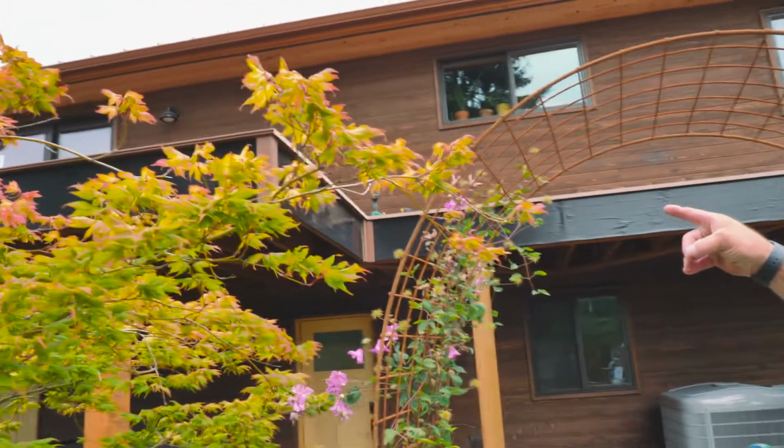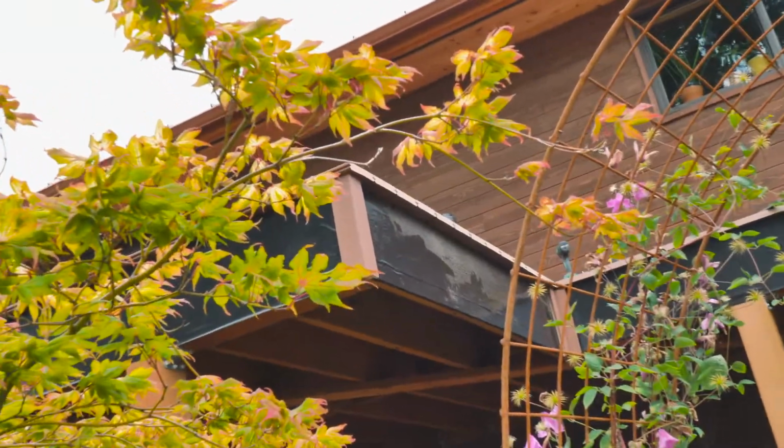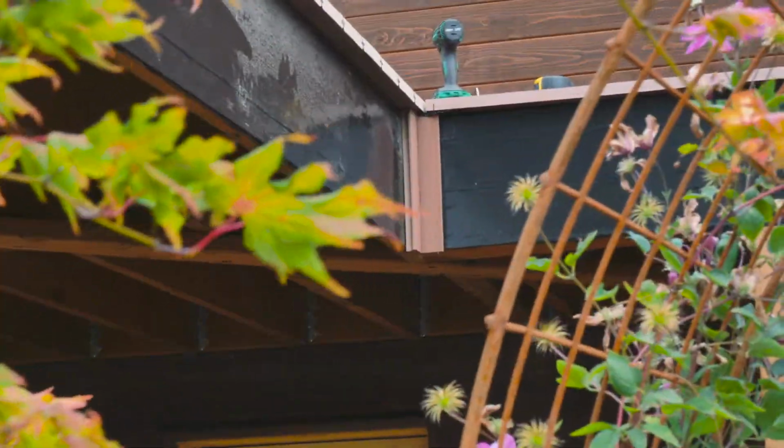All of our decking's laid, our staircase is in, all the trim on the staircase is done. So now we're putting up some trim corners up on the deck. They're special corners that we made last week. And all of our fascia is gonna slide in between those corners. Then after that's done, we're gonna wrap the end grain with a special detail that allows the water to still drain off of our waterproof deck and in between the trim and the deck boards.